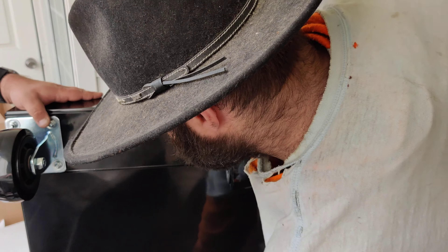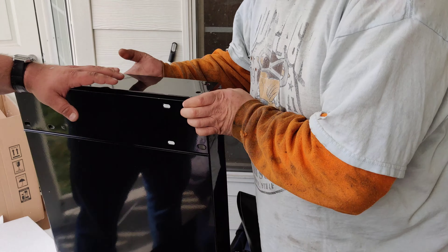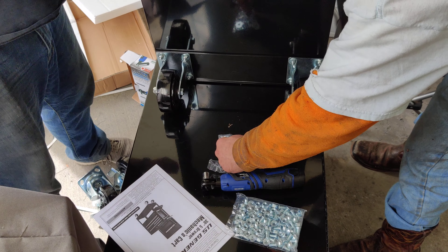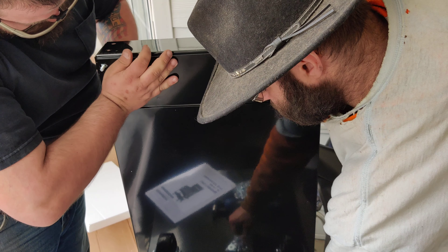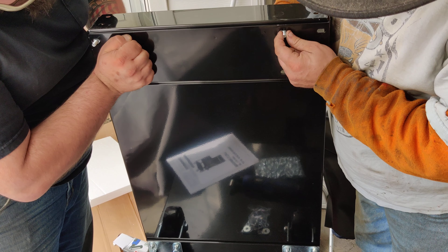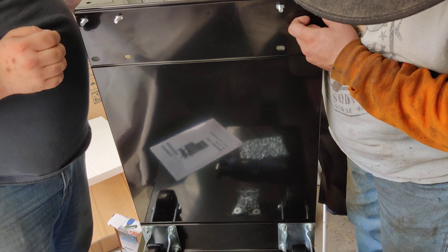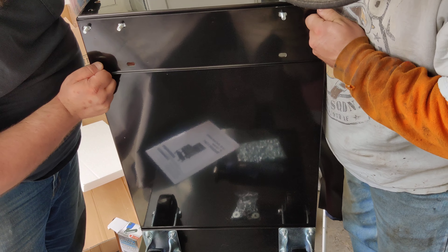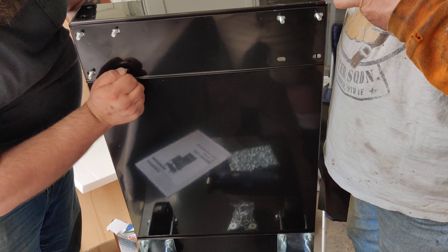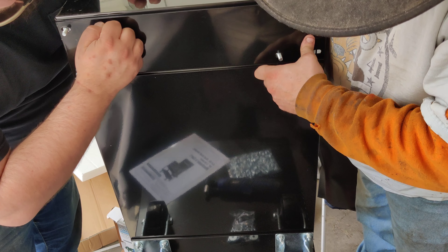Well, I'll say it's one of the few videos where I've actually shown doing some form of work and not just talking about it. Okay, now this is going to be a little more stable. A bit of pressing action with your thumb, or maybe a small hammer, can get these to fit inside the little notches. The powder coating process has probably made them a little tight, so you can even take some sandpaper or a file and rub a lot of that out if you want these to fit, or you can just push them through like we are.